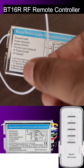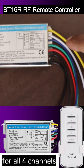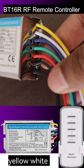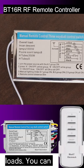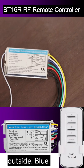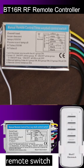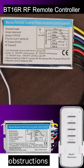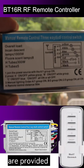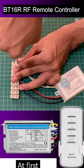The controller is provided with an antenna wire and connection wires. Two black wires are for common neutral for all four channels. The red wire is the input phase supply, and the other wires — green, yellow, white, and blue — are for individual loads. You can place this controller box inside the switchboard and keep the antenna outside. Blue is A, white is B, yellow is C, and green is D. This is an RF remote switch, so no need to worry about obstructions in the remote path. It has an original Toshiba IC and other specifications are provided on the controller.